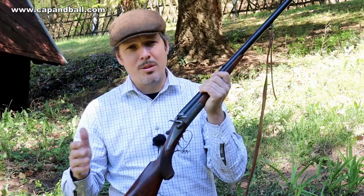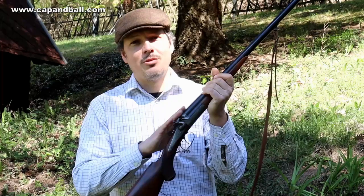The 11mm Mauser is a very important cartridge in military and firearms history — it was the very first caliber for a bolt-action rifle manufactured by the Mauser brothers. I will also show you how to reform cases from 45-90 to 11mm Mauser, since I have 45-90 cartridges for an 1886 Winchester, which is a good basis for reforming to exactly match the bore of my 11mm Mauser rifle.